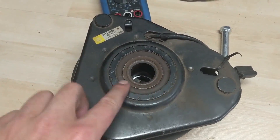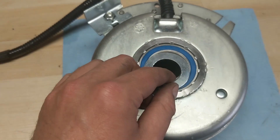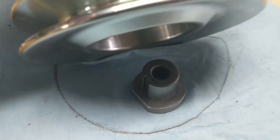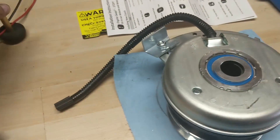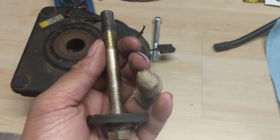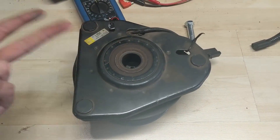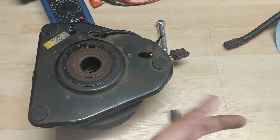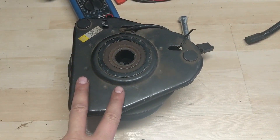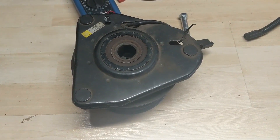Comparing the PTOs: the original doesn't have a washer, but the new one has a thrust washer, and on the flip side there's an adapter spacer that will need some nickel anti-seize. Previously, all I did was a 12-volt test — back-probe the connector, put 12 volts to it, it clicked, and that told me the PTO itself engaged. But that didn't tell me whether the windings had a short, and that was the problem. Once I found out he was melting PTO switches, I knew right away the PTO had to be replaced.